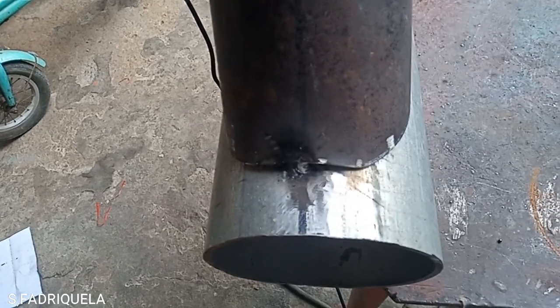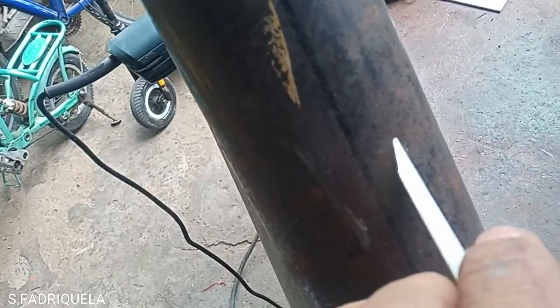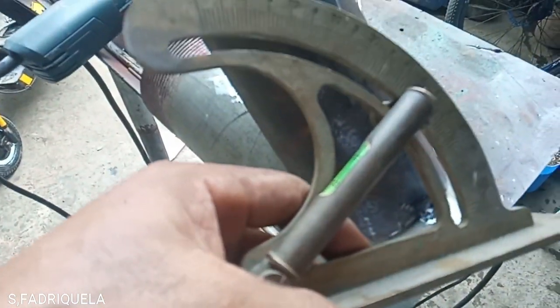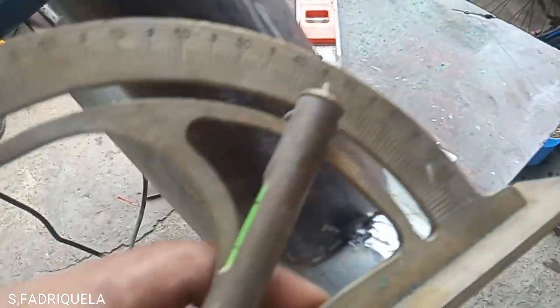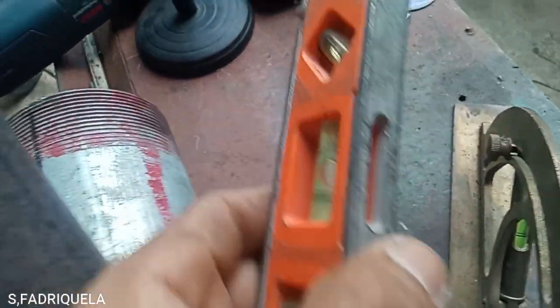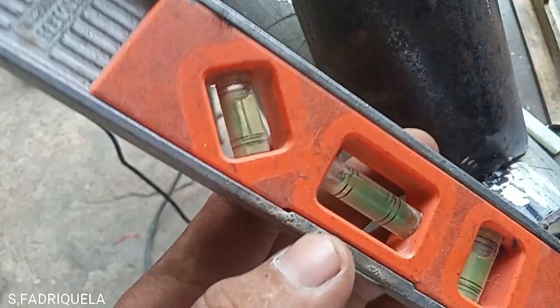In this technique, what you need is only chalk stone — the stone that we are using for marking a pipe. By using this we will do the lateral manually, and by using this kind of level degree finder you can adjust it to a certain degree that you need. You can make a lateral using this technique in any degree, but if you will make a normal lateral — meaning 45 degrees — you can use this spirit level for this technique.